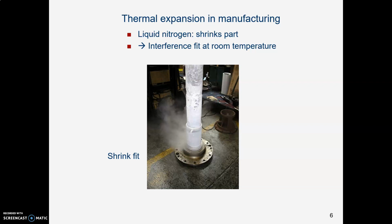In manufacturing, there is a class of fit called an interference fit, where the thing that goes in, like a shaft or a pin, is actually bigger than the hole it fits into. How is this possible? Well, with a light interference fit, a press fit. That's called get a bigger hammer by some people, or get a hydraulic press where you can just press the thing in.